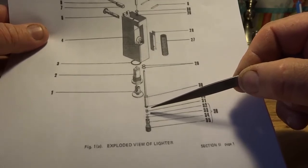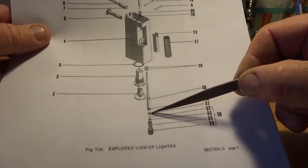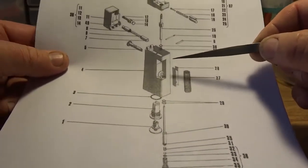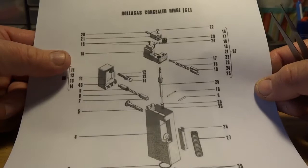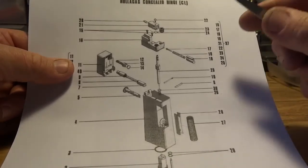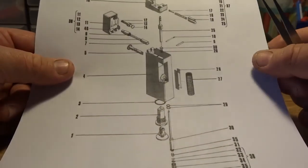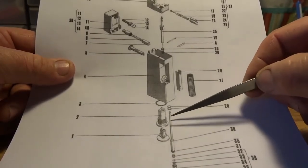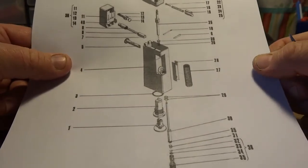These little bitty jets down here — I had to order some from Japan or China, they're like five dollars each, maybe more now. If you unscrew this and pull it out and lose that little spring, the lighter will still work but it's going to mess up your flame adjustment. These are quality lighters, don't get me wrong, but after rebuilding several different brands I've just decided to stay away from these. The little seat inside the needle valve is really tiny.